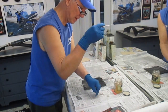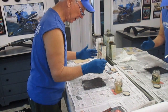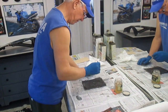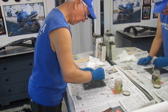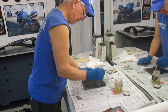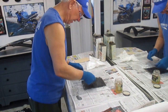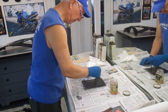I'm laying that out. One of the tricks of doing this kind of work is to have the fiberglass or carbon all cut up ahead of time, because once you start working with resin your hands turn into flypaper — even if you're highly skilled. My answer is just work faster. Also, never mix more resin than you really need — this resin will harden much quicker in mass, and when it hardens in mass it can heat up and smoke.